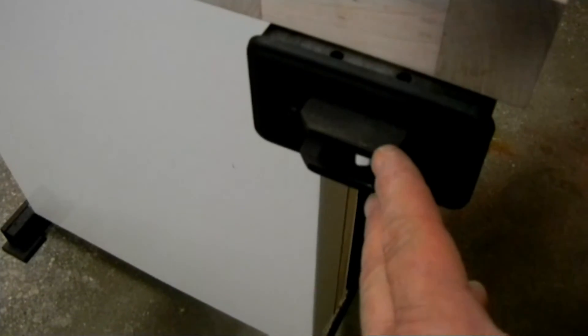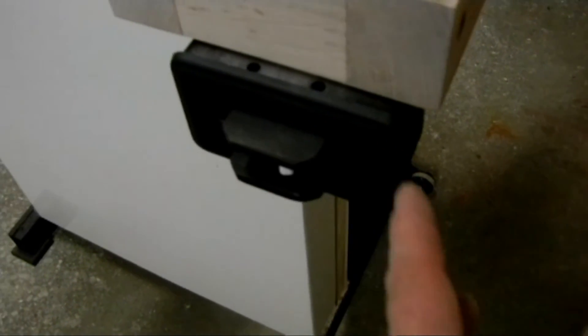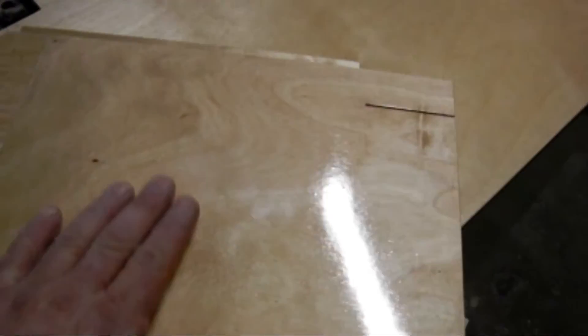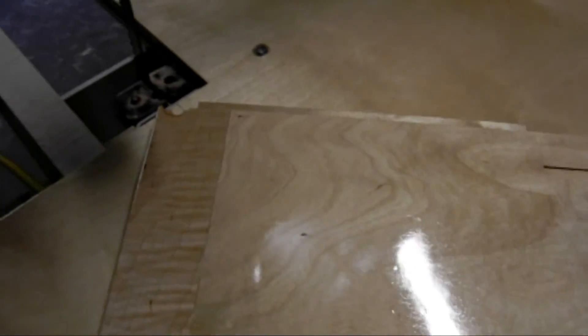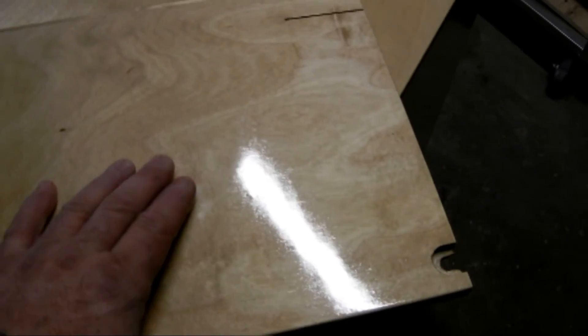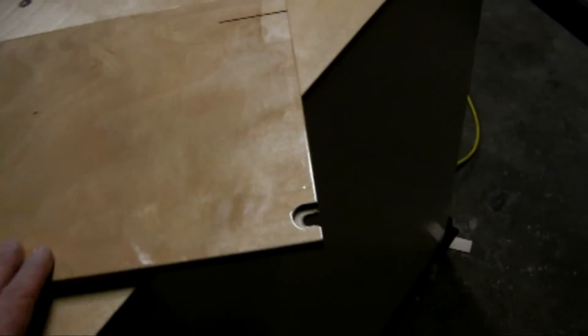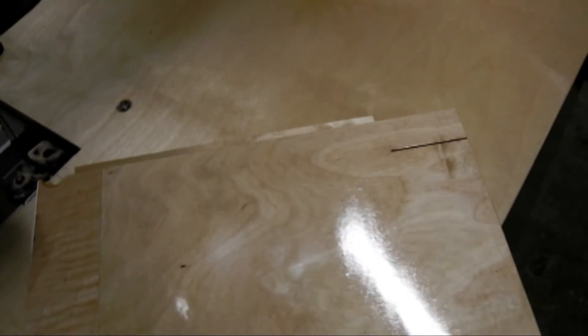Here are the guards that I made — these are just quarter-inch plywood blocks that I glued on to the face of the metal cover plate. The top has got four coats of gloss polyurethane, and my experience with my router table is that this will stand up to a lot of abuse. The good thing is that once it starts to wear, I can always take the top off — the top is not glued on in any way, it's just put on with two bolts and four smaller screws, so I can take the top off and refinish it at any time. This finish is sprayed on — I like spraying on the finish because it's a lot quicker and you get a more even coat, and you can get four coats in one day, actually in less than one day.